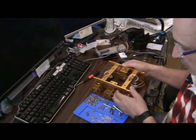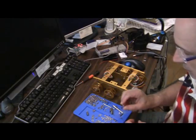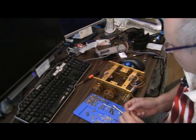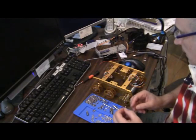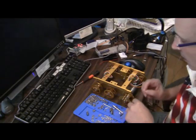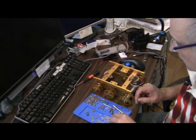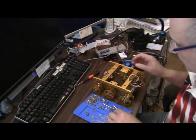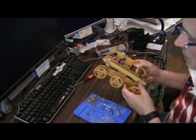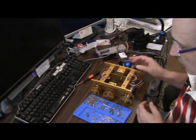When hooking up the brackets on the lower parts, you're going to use the longer thin screw that has a Phillips head. What I did was I put the screw head on the inside, I put a lock nut on the outside of the lower member, and then I put a regular nut over the lock nut. I have no idea if that's the right way to do it. It's still a little loose when you do it, and I've tightened these up. Maybe that was intended, but I find no other screw that seems appropriate for that.